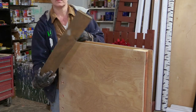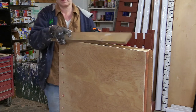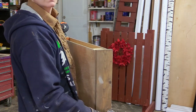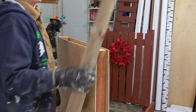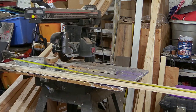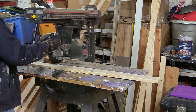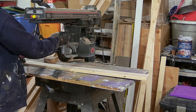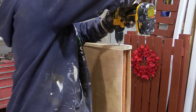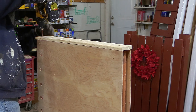Then it was time to add the wood that's going to frame the standard. I had intended to use 1 by 2 inch lumber, but I found that 1 by 3 inch lumber actually fit perfectly, so I used 1 by 3 for the top and one of the sides. I measured off how long I wanted each piece to be, then attached it to the standard using 3 and a half inch screws, securing each end through the landscaping timber underneath.